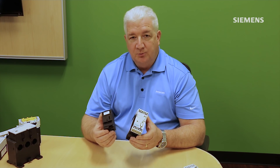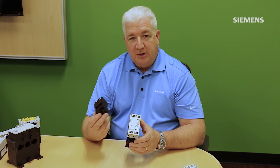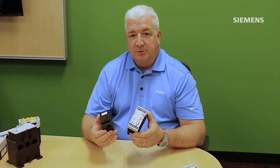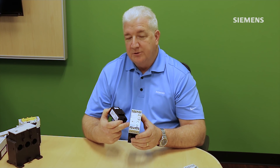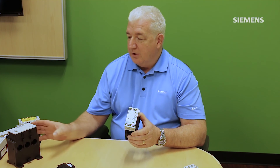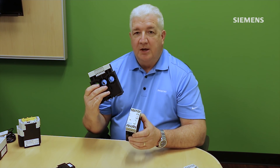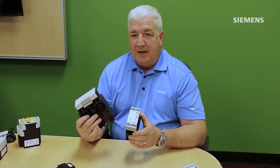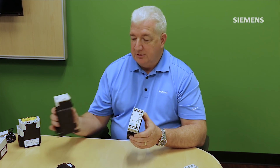As you can see it's a two piece design. The benefit of that is for all different sized motors, what changes is the size of your CT, not your base unit. So from a replacement parts standpoint you only have to inventory one part number for all different sized motors in your plant or facility. The CTs or measuring modules change in size and capacity as the motor size changes, and CTs will be able to measure up to a 63 to 630 amp range, so roughly a 500 horsepower motor could be protected by this same system.